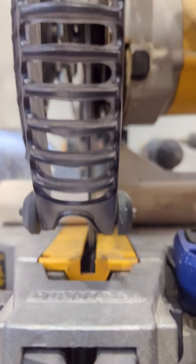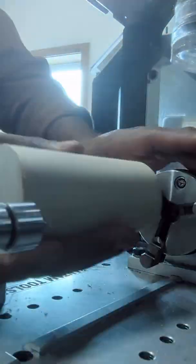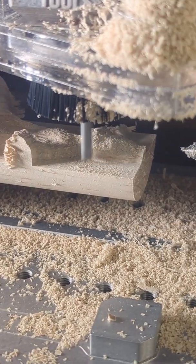For baby Groot, we're going to be starting off with a dowel rod. This is maple, two inches in diameter, and we're going to be using the fourth axis today. The fourth axis is going to allow us to flip our part and basically complete two operations all from one fixture holding.